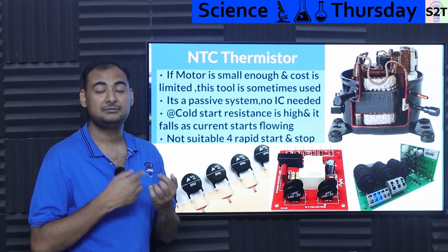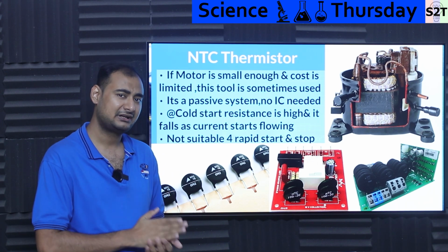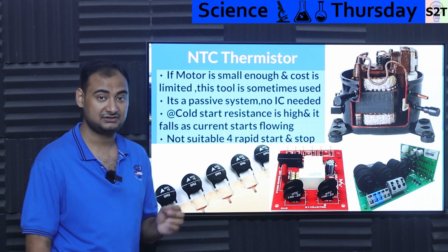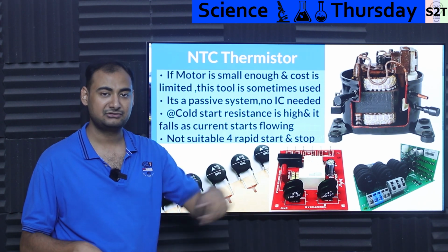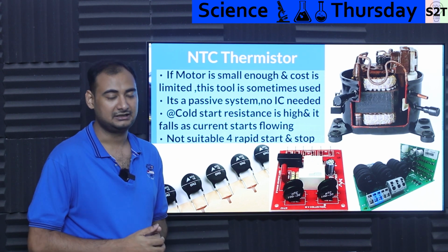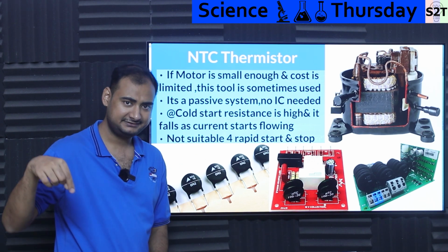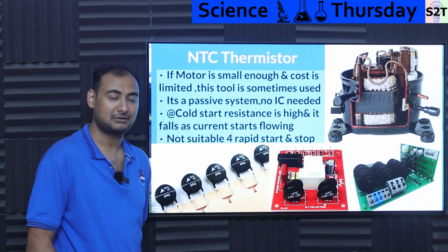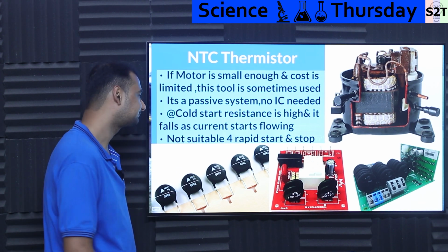Now, be mindful, many people have to use tools. Tools generally utilize universal motors. They also have inrush current. In those scenarios, these things are a lifesaver. I have linked a video down below where a gentleman just makes an extension box, and it's like, plug it into the inverter, plug the angle grinder into the inverter, turn it on, the angle grinder tries to draw power, and the inverter trips on overload. Put an NTC in line, voila. You can run your power. And be mindful, it's just the starting that is the issue. After it starts spinning, no problem.